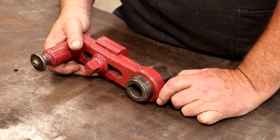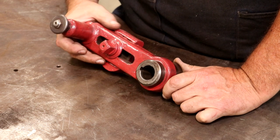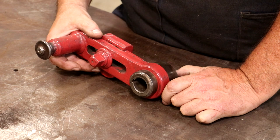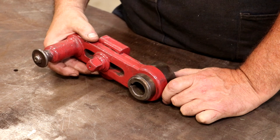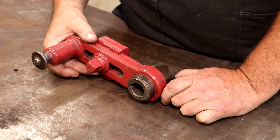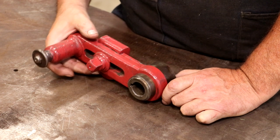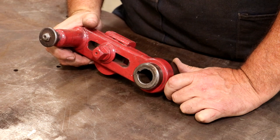Brazing is my preferred way of repairing cast iron. I know there's a lot of opinions out there — a lot of people say you need to weld it with a nickel rod, or talk about TIG brazing versus flame brazing, and so on. I'll just say that I have had a lot of good luck brazing cast iron. My success rate brazing cast iron, at least in recent years, is almost 100%. I'm comfortable doing that. I'm not going to say the other ways can't be done, but this is what has worked well for me. I've got a process down and I'm sticking with it.